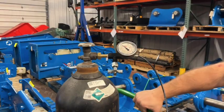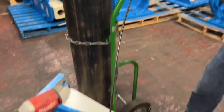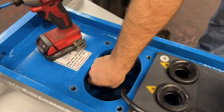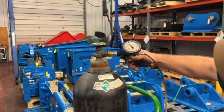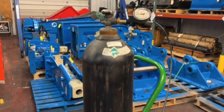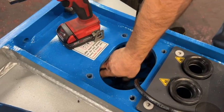I always recommend setting it to the top of the range because it will bleed off. Now that we've got good nitrogen pressure, we can back off this thumb wheel. Again, make sure the bleeder is closed, which it is. Bleed off the line, and then you can just unscrew this from the port.